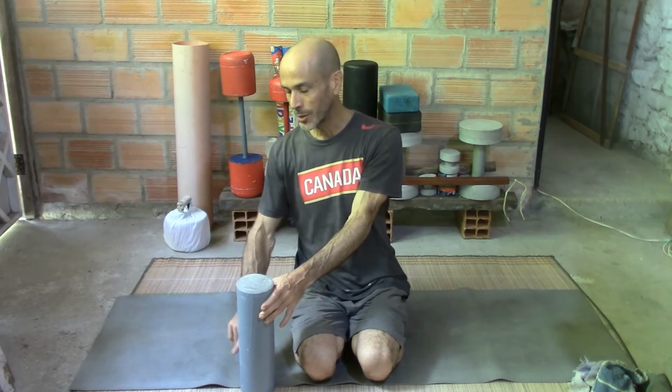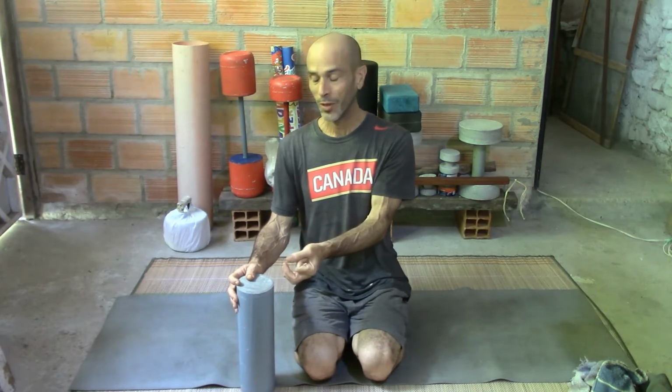I didn't in the end have enough cement to completely fill the tube, which turned out to be a good thing. I was about 1 centimeter short from reaching flush with the top, and I noticed after about an hour of letting it sit on the level platform that the cement sunk a little bit. So I used a pair of scissors and just knocked all around on the sides, and I saw one big air bubble come up and a few other bubbles, and then it dropped about another centimeter.